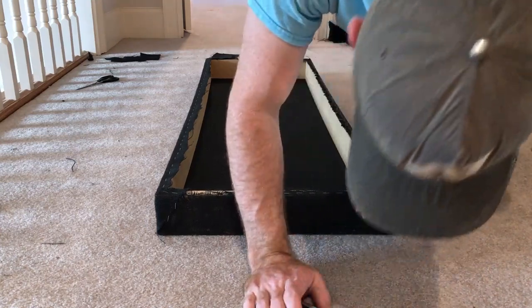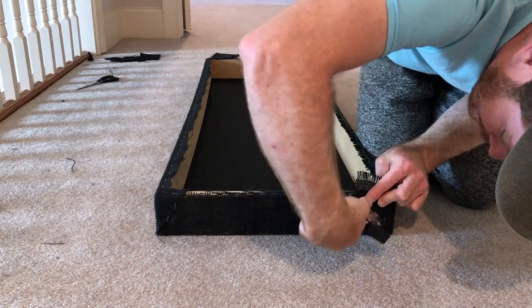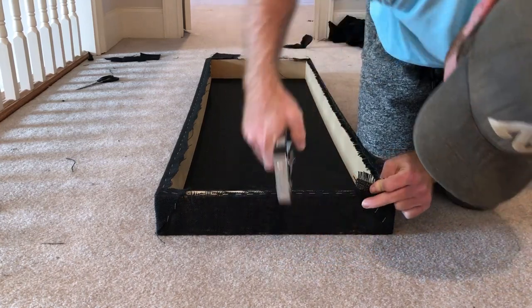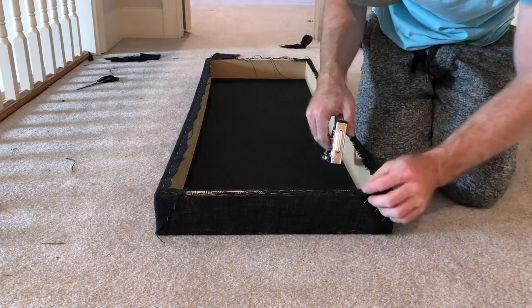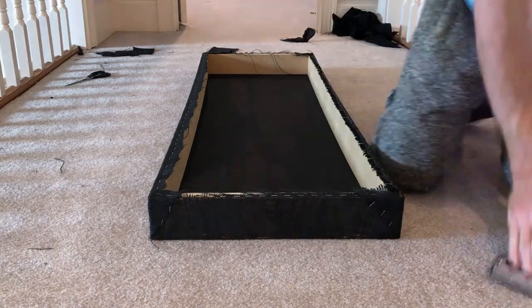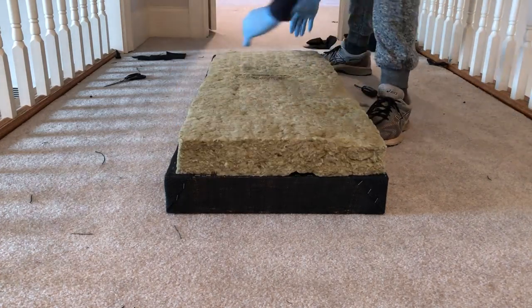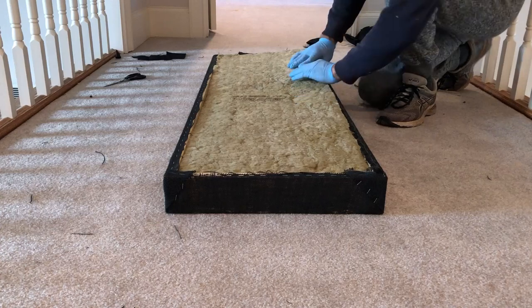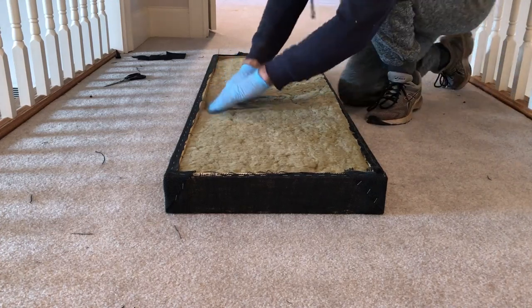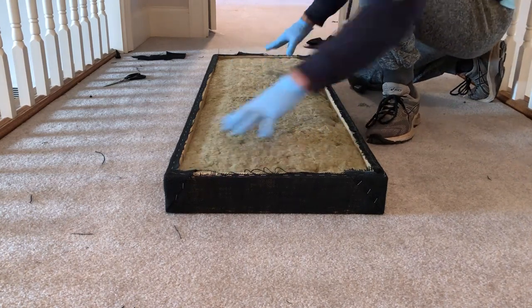The corners can be a little bit tricky, especially if you're planning on adding extra wood onto the sides of the panels, because you don't want the fabric to overlap too much and create a hump where the wood won't sit flush against the frame. What I did with my other panels was cut off the excess fabric along the corners — just be careful not to cut too much so the fabric still covers the front of the panel. Once the fabric is attached, we just need to put in the insulation and we're done. You don't want the insulation touching your skin, so wear gloves, a long-sleeve shirt, and a respirator or N95 mask. If all dimensions are correct, the insulation should fit in snugly. Push down the edges to make sure it's sitting nice and tight against the fabric, then mount it on the wall and you're all done.